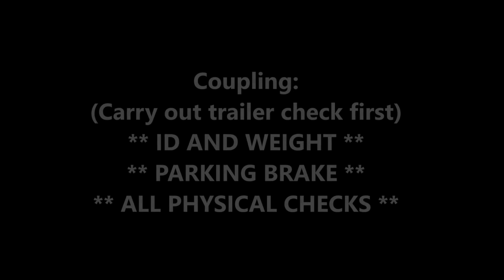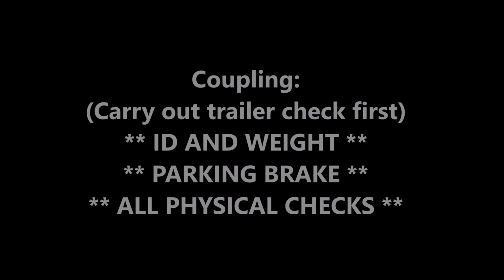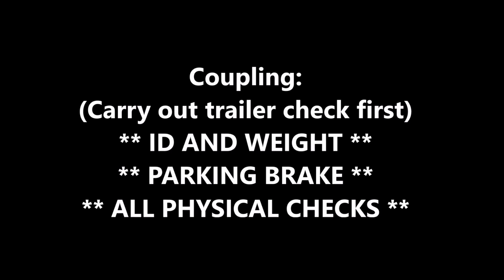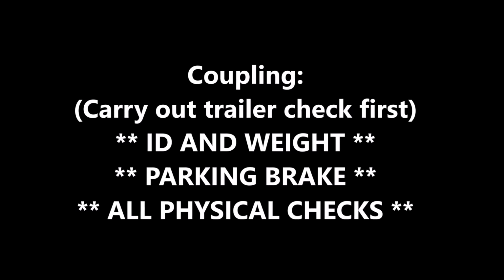So, to sum up that coupling procedure then, we're going to carry out that trailer check first. Going to make sure we have a nice physical check of the parking brake to make sure that's applied. We're then going to carry out all of our normal checks, so our tyre tread depths, the condition of the tyres, our security of the wheel nuts. We're going to check out the suspension, the spray suppression, all that stuff you'd normally expect to check.